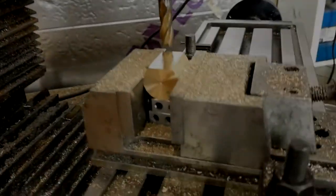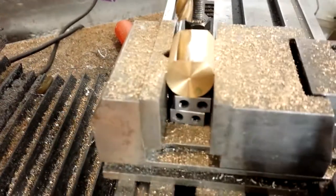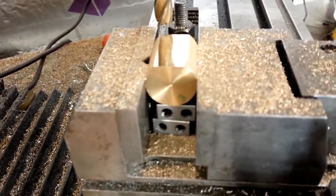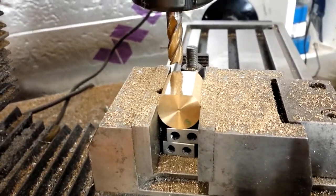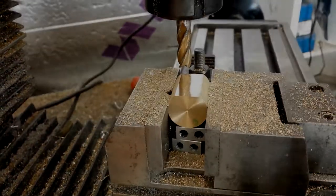So we're going to get milling. There's a nice flat milled on the cylinder, so that's going to go in the lathe now to drill and ream the cylinder bore. That will be bored eccentrically to the bar — I'll show you how that's going to happen in a minute.